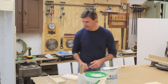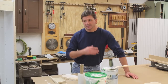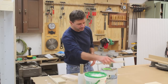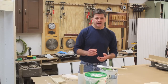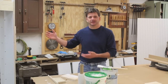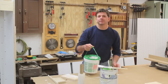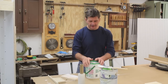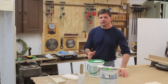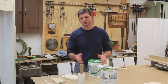Another question was how am I going to finish the bookcase. I generally finish my painted projects always the same way. I start out by sanding the project, then priming it — I usually use Fresh Start by Benjamin Moore, which is a latex acrylic primer. It's a heavy-bodied primer so it fills some of the imperfections. Once the cabinet has been primed and it's dry, you can really see the imperfections because they're darker. Then I'll go over with joint compound and fill all of those imperfections, whether it's a nail hole or a gap in the miter. Once the joint compound is dry, I'll sand the whole cabinet — sanding the primer and the fill at the same time. Then I'll usually use two coats of semi-gloss latex paint. Sometimes I'll use an oil paint, but I prefer latex.